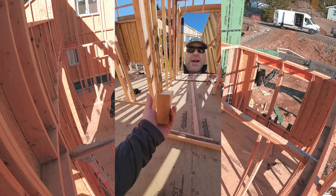Just a bunch of inside walls — really there's nothing special here. This wall is just where the stairway goes, so it's the door that goes under the stairs. That was the section of wall I had just laid out. I'm going to strap the top. There are only a couple of walls left on the backside, so I framed to the left of the balloon framed wall in the great room just because I had more space, then I can slide that in. Our goal was just to get all the walls up and locked together, then we could plumb and line and start framing the floor — but that's going to be a future video.